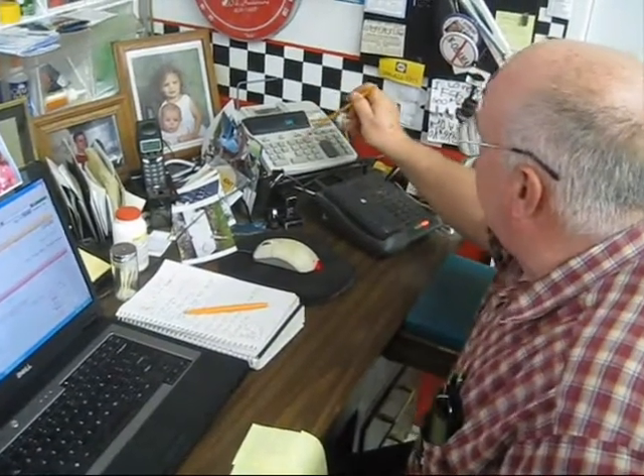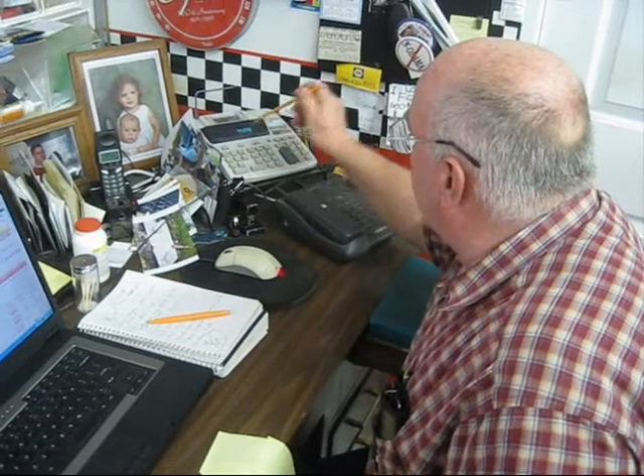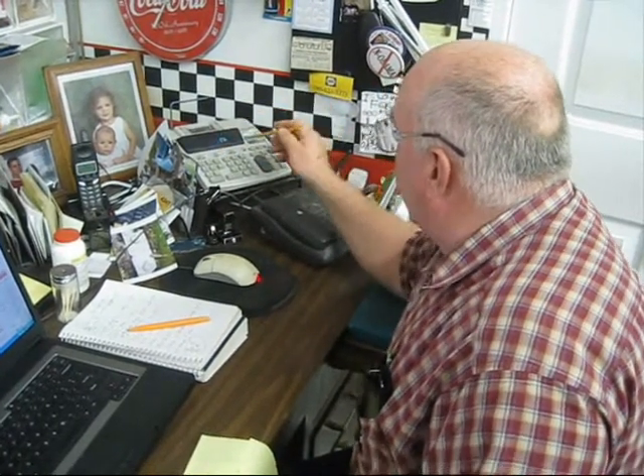So you keep track of it on here, Dave, and that way you'll make your calculations and increase the values based on the volume that you've got. We know there's 568 liters in 150 gallons of vegetable oil. We multiply that times 7.8 — that's 4,430 grams — times 0.002205, gives us 9.76 pounds of lye that we'll need to do the reaction. The volume of methanol is proportionate — we'll use 30 gallons of methanol, which is 20% of the 150.